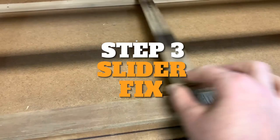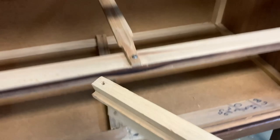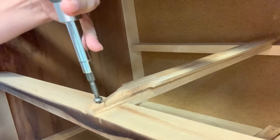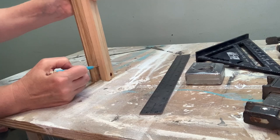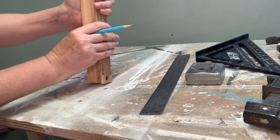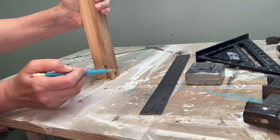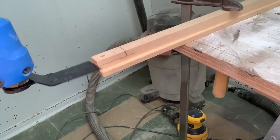Once the fronts of the drawers were all fixed up, I had to move on to fixing the drawer slides on the interior. Two of them were in very bad shape so they needed replacing. I found two drawer slides I had saved from a curbside piece — I keep these parts because you never know when they'll come in handy — and they fit perfectly. I just had to cut out the notch, starting by removing the old slides, then measuring out the notch on my new drawer slide by placing them together and using a ruler to measure how deep the cut needed to go, so the slide can sit on that wood piece inside the drawer.